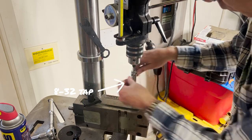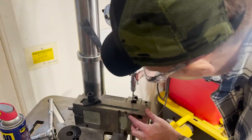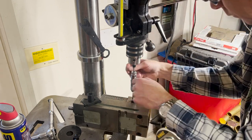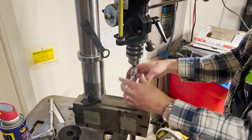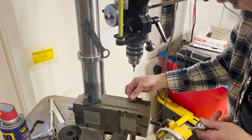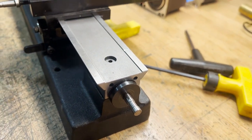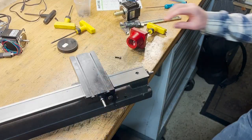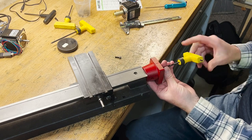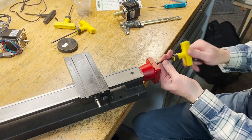It made it extremely careful. I shouldn't have worried so much — there was really no risk of breaking this tap. I think it's just due to having a clean setup and doing things right. It worked out very well. You can see those holes came in dead nuts, right where they need to be. And you can see now I'm mounting that motor mount — it mounts in with those two 8-32s. This is the Z, and the X axis. You can see those holes if you look carefully; they're already there. Those came from the manufacturer.